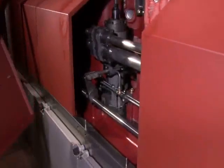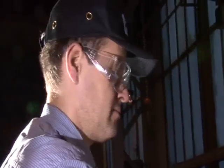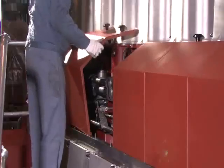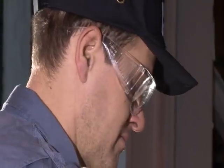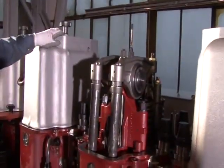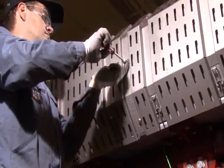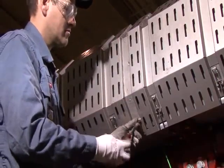The pump space cladding is removed from the cylinder head to be dismantled. The valve cover is dismounted. The exhaust cladding is removed from the corresponding cylinder.